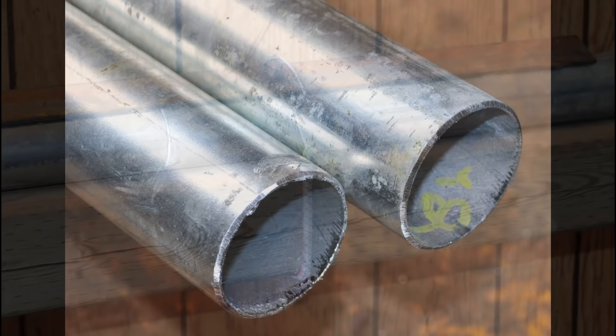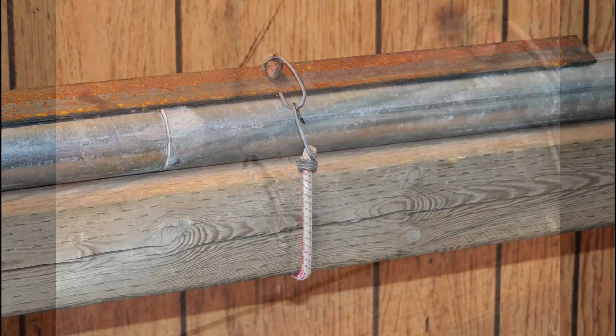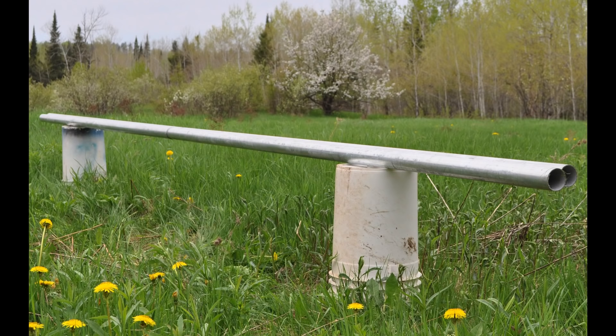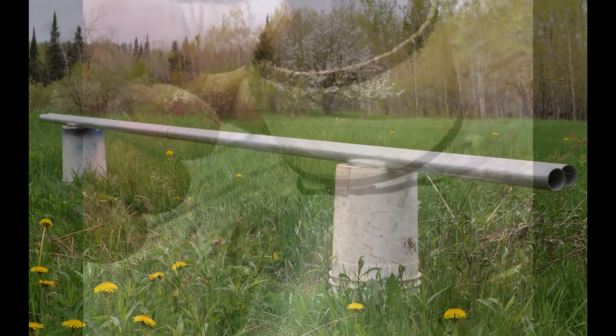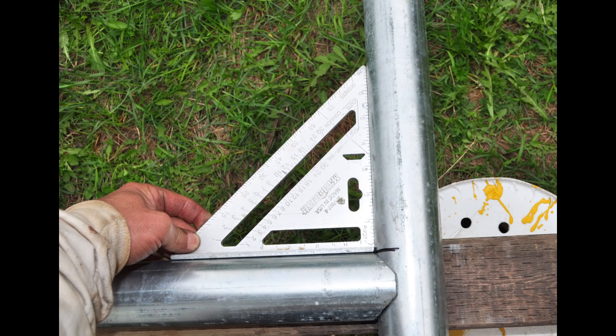I have only a basic hardware store welder and hand tools, but you can build a lot with these. You do not have to have a machine shop. This photo shows the two fence tubes lined up for welding end-to-end. If you have a farmer homestead, welding is a great skill to have — for a couple hundred dollars you can get all the equipment you need. There are really only four welds to make on the main frame: the two long pieces joined end-to-end and the 9-foot pieces at the front and back that join the two side rails together. I used a handheld angle grinder to cut out a round section so it fits against the other tubing and is ready for welding.